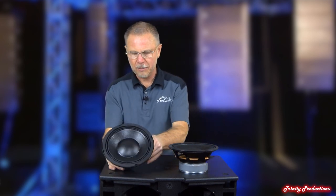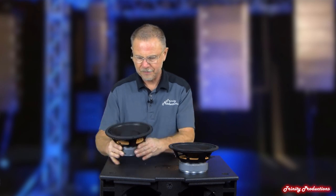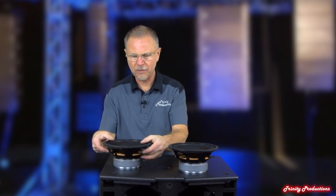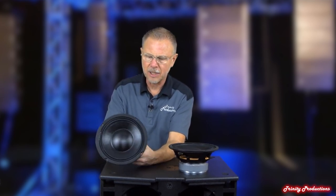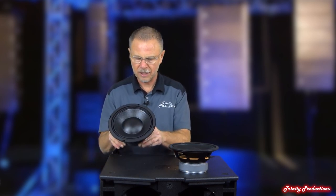We're going to pull some drivers and see what's inside. Here is the entire reason why this cabinet sounds the way it does — nice large ceramic magnets on these. They are four-ohm drivers wired in series, presenting an eight-ohm load to the amplifier. They're not long excursion, but very tight, which is why it's so punchy. I think this has a two or two-and-a-half inch voice coil, stamped basket. The magnet assembly is just absolutely phenomenal, which gives it the acoustical properties, punchiness, and power handling. There are two of those in that cabinet.